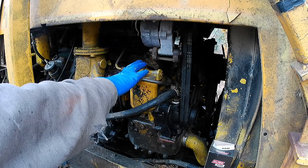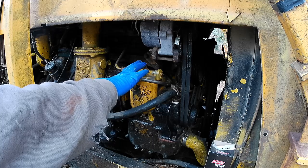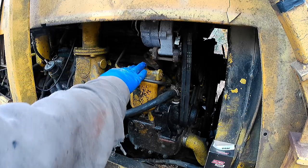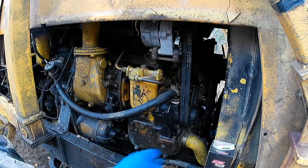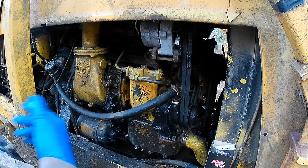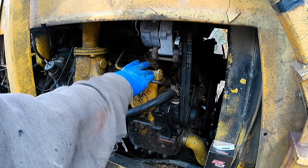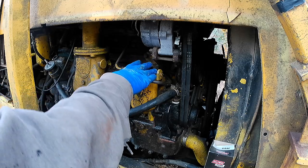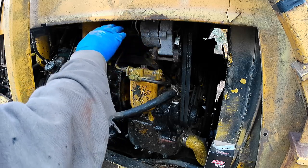If you run out of fuel and you hear this machine dying because you've run out of fuel, stop it. Because next thing you're going to have to put air in the tank, open everything back here, pressurize the tank, and try and force air back through it. Because you'll turn this over and turn this over till you're blue in the face, and you will not self-prime this machine. The injectors in this will not pump air. So that's the most important thing.